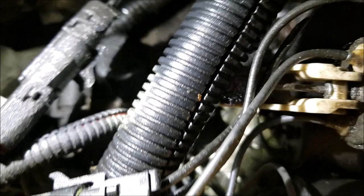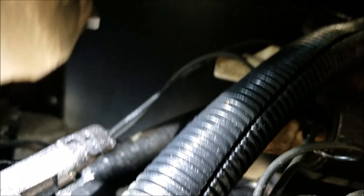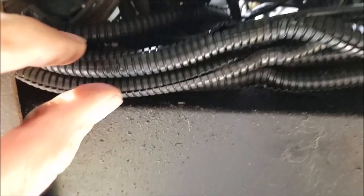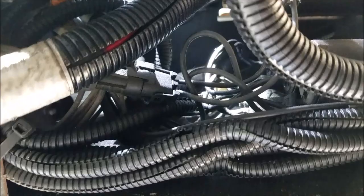If you don't know to check the oil in this tank, the dipstick is sort of down in here in this mess of wires - it's a little black plastic piece, hard to see. Anyway, when you go to check your oil, there's all kinds of dirt and grit that gets on top, so you want to be extremely careful. Spray some brake cleaner and blast it with some air before you ever remove that dipstick, so you don't accidentally drop a bunch of grit right down into your oil reservoir.